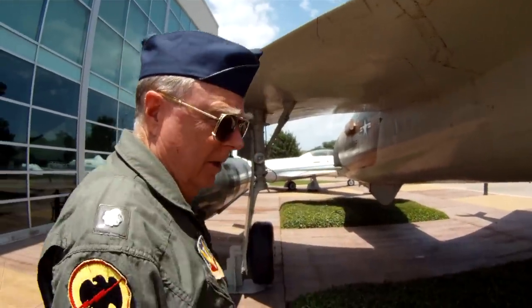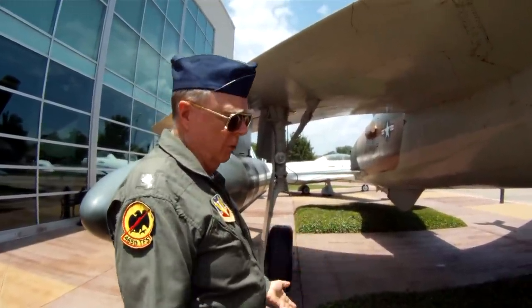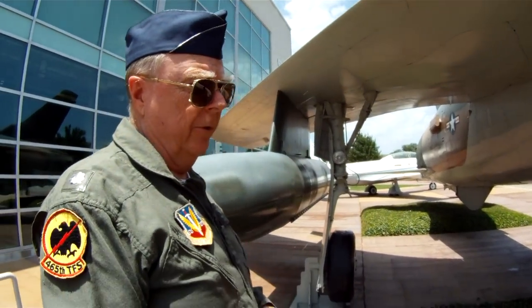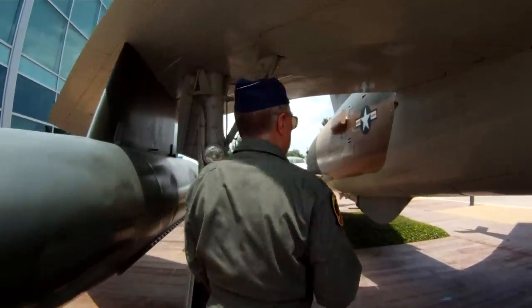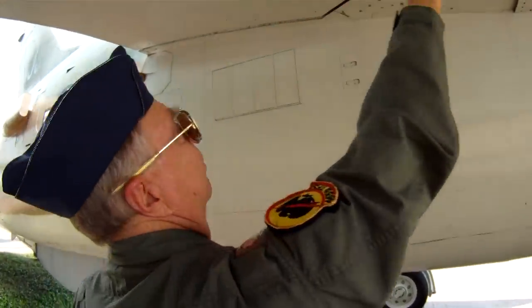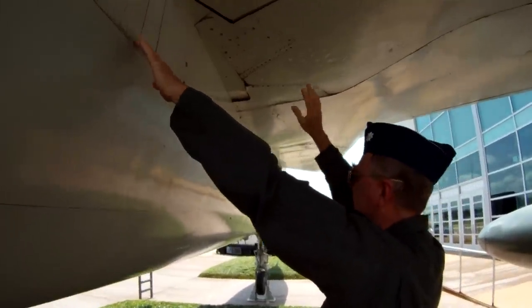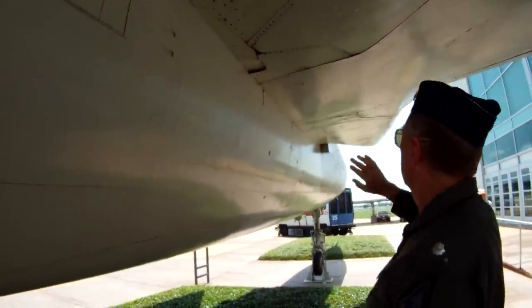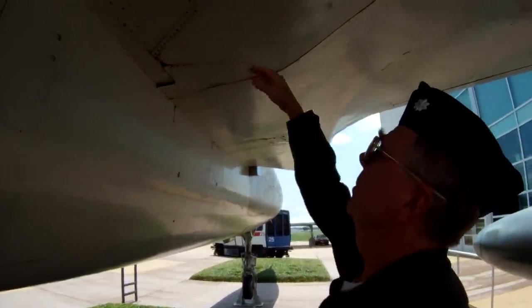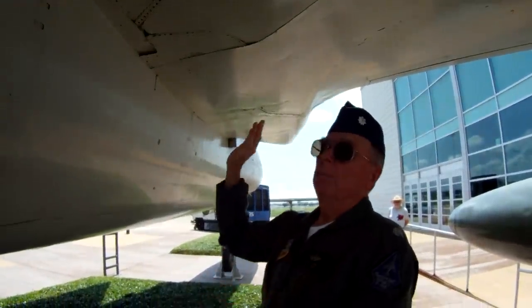This is the bomb bay area. I've got to tell you that one of the worst things a fighter pilot can say is that he flew an airplane that had a bomb bay — but this had one, primarily for nuclear weapons. When you had no nuke on board, you could have a fuel tank carrying 3,200 pounds of fuel. These doors — normally this little flipper door would be down, and inside that flipper door there were bleed vents. When the plugs were in operation, sometimes the air pressure would be too great, and this would bleed the excess air off. When the gear is down, this door was available to let extra air go to the engine for takeoff. Once the gear comes up, it mechanically closes those off.